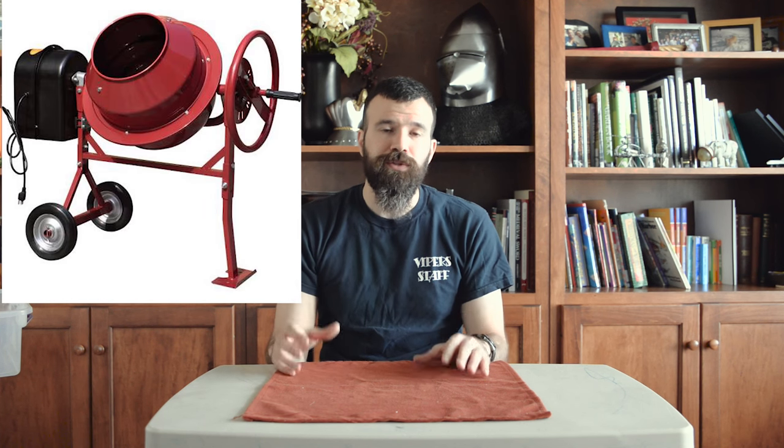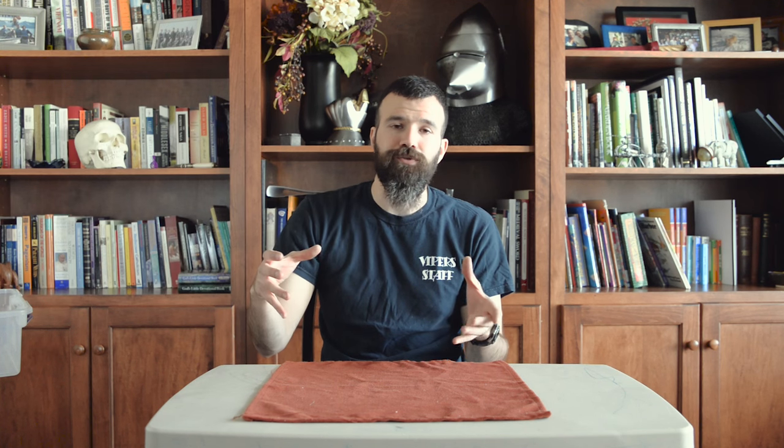Here's an example by my friend Tom Billiter's company, Historically Patterned Mail. He uses a vibratory tumbler for smaller mail and you can see here what it looks like in action. And here is a before and after of some rusty mail — he was using relatively old walnut media, so this isn't even newer walnut shell — and you can see it takes a lot of time but it does get the rust off. There's no comparison between the first picture and the second picture — it's clearly cleaned the mail. Other people report great success with cement mixers, where you remove the baffles from the inside of the drum so you have a smooth interior, put your mail in with some tumbling media, and let it run, and over time you have clean mail.